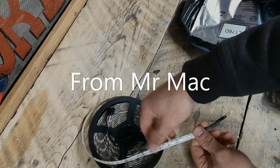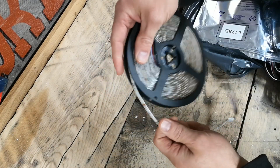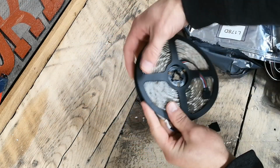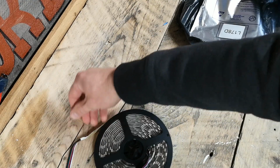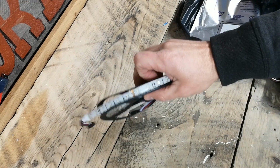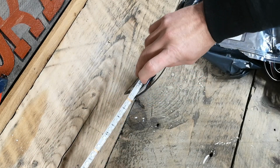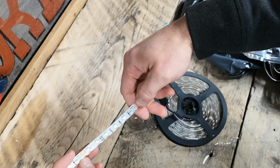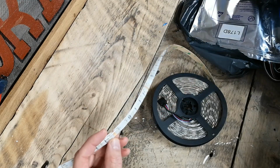And the WW is warm white. 24 volts. I went for the 24 volt option because there's less risk of any drop in voltage for extending the run. At the moment it's 5 meters, but I can extend this run up to probably about 10 meters off the same transformer. The 24 volt can also be cut every 100 mil, so you can cut it to size and then you can join on with